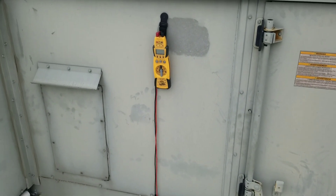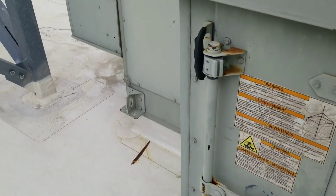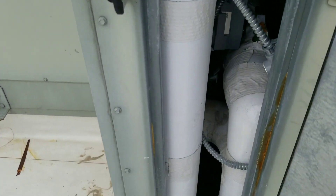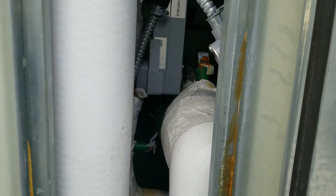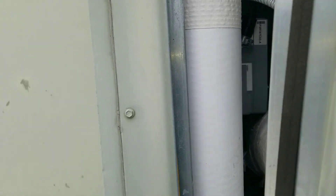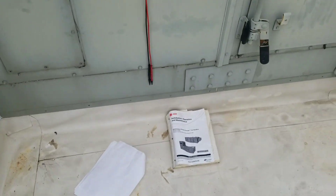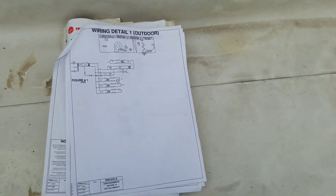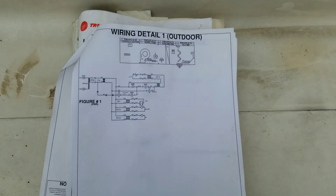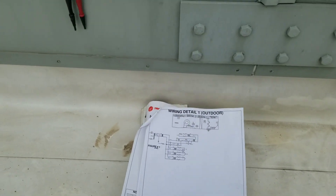We're going to watch this unit operate for a little while and see if we can find anything wrong. I got it reset and it's been running for a little while now. All of our cooling water controls are in here — see the actuator — they like to shove everything into a nice small space, so good luck getting in there. That's what I found. I did not know if these had a reset like that, but that's where the alarm on the BAS was coming from. We're gonna keep an eye on it and go check space temperatures.